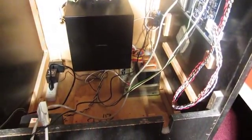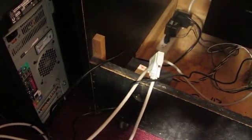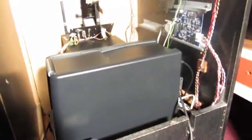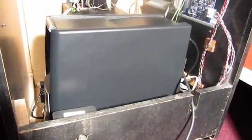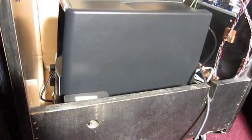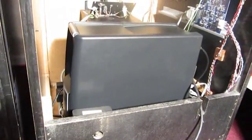Everything should be ready to plug in. We've got our parallel cable coming off over here and that's going to plug into our PC as well. We plug everything in and now we're ready to put the box inside the machine. The PC is in the cabinet, everything is plugged in, and when we hit the power button the vector monitor should go into spot killer mode until the PC kicks in, then the machine should boot and we should hear the vectors being drawn.